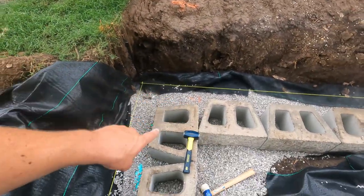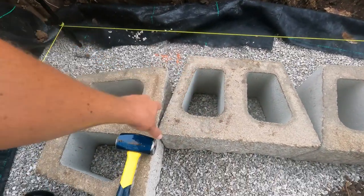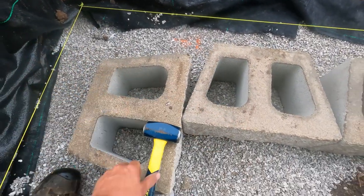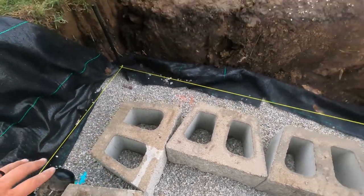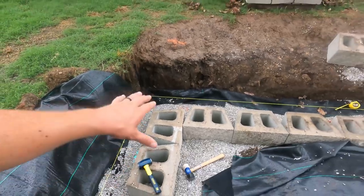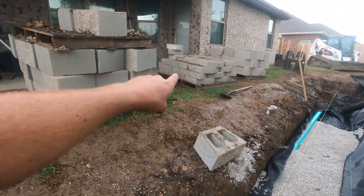You can see here what we do in a corner. We'll have our next piece up, we'll have a half inch overset. So that piece will come over here. And then this piece right here will be half overset. So we'll go into that one. I'll blend these two corners together, and then we're gonna have our caps as well. So we've got our 4-inch caps up there,